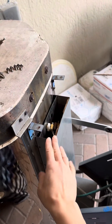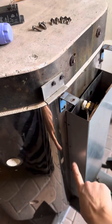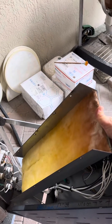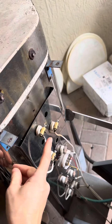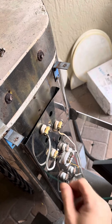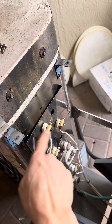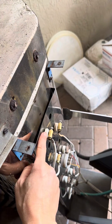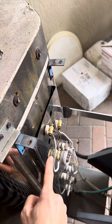These are your hot parts, and that's why you have this protective covering over them. I also removed all of these screws, and you can see how the heat has affected the insulation — that happens when these get a little too hot for too long. I do have a separate video on trimming them, but these are the ends of your elements. Those elements that are coiled inside your kiln — this is where they come out on this side. You'll have an insulated piece right here, and then this is your element tail and a connector with a wire.